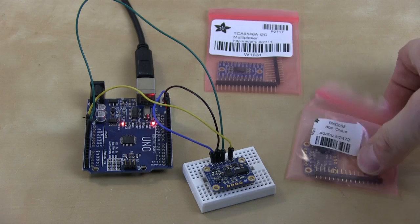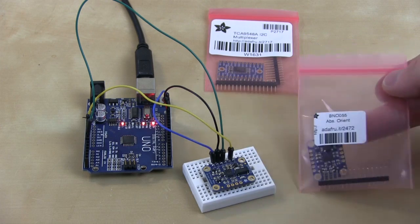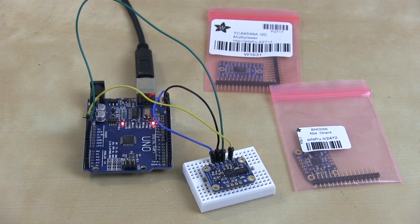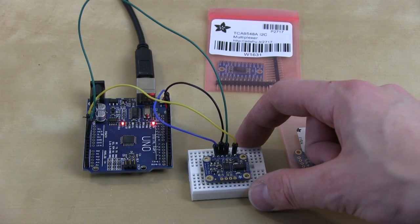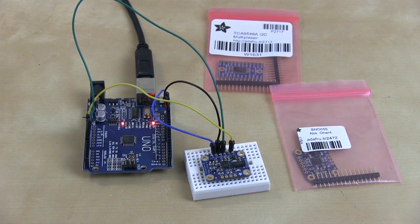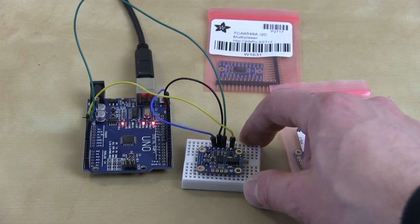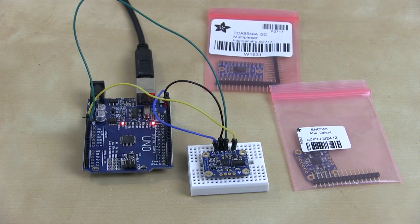The sensor I'm using this time is an Adafruit BNO055, which is a Bosch part, and Adafruit have put this on a breakout board and written an Arduino library that's part of their sensor library suite. This is really good actually, because it does lots of the maths for you. When I did my ball balancing version of BB-8, I had to combine the sensor data from the accelerometer and gyro and use arctan and all sorts of complicated things to try and actually work out the absolute angle I was getting from it. This board does all the maths for you, it just gives you the angle, which is really, really good. So it takes a lot of processing off my 8-bit Arduino. All I need to run on there is a PID loop, which will be quite easy to do.